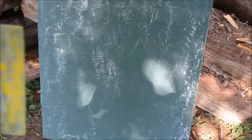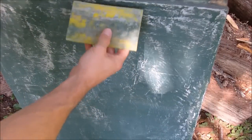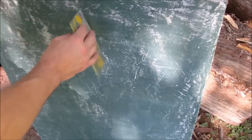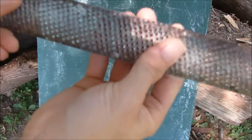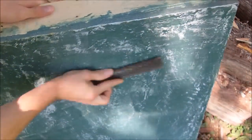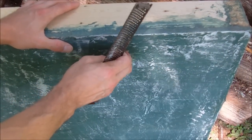You're just going to smooth it on, press it in, and smooth it all on. You're probably going to have to do it in halves — I did half and then the other half, then put a last coat on top just to fill in the remaining indents. And it's also a good idea to smooth the surface down a little bit because the solar cells are going to be resting on top of that. I've just taken this body file — it's like a cheese grater — and you can just go over it to take off the high areas so you don't have your cells sitting on top of a lump of fiberglass.